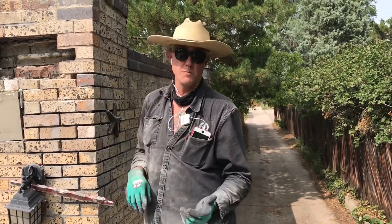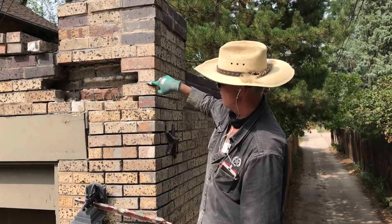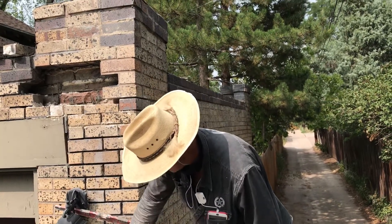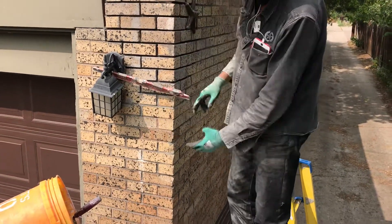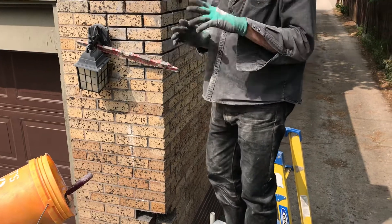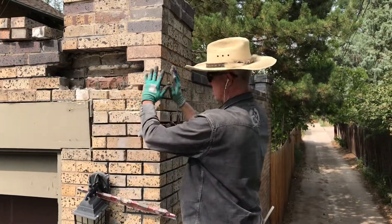This is also a little bit of a color job. You can see right here — these bricks actually got relaid at some point with a pretty hard mortar, but you can see the color difference. And then this was tuck pointed at some point, so they've got a couple of colors happening. We're going to try to hit one or two colors — we're going to grind out more of this going that direction and then tuck point it all back to the corner.